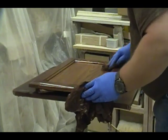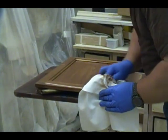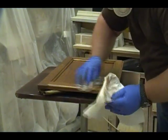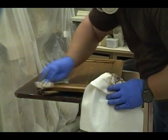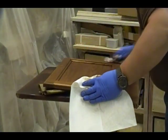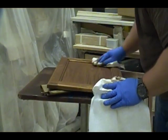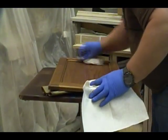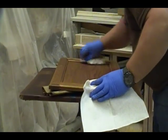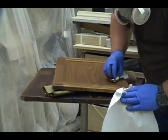Just using a couple of dirty rags to wipe off all the excess, and I'll come back with a couple of cleaner rags for the final detail cleanup. As you can see, I'm using a couple of clean rags doing the same thing as on the previous door — making sure there are no rag marks or smears. Anything stained really needs to be perfect prior to the next coat of clear, because once you put the sealer over it, it's pretty much locked in for life.